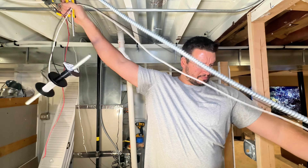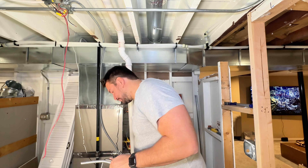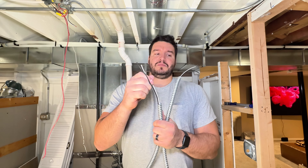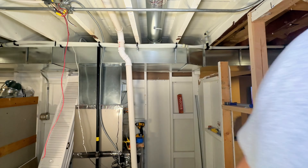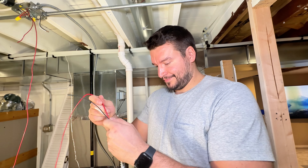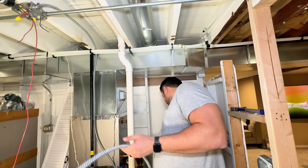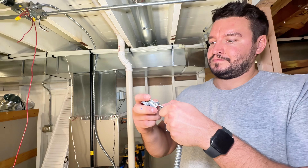Then you get your wire out. I started with two wires but that's not going to work for the switch. I'll cut it to length, feed it through — voilà, you got a whip. But that won't work because we need another wire for the switch, so I added a red one. Feed it in, get it roughly the same length. We got our whip — now put the elbow on there because we want to run it flush to the ceiling.